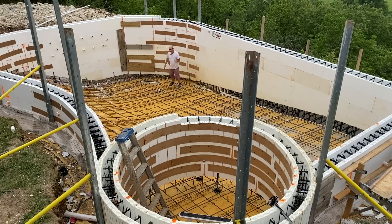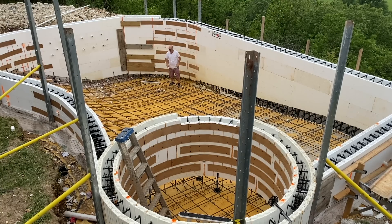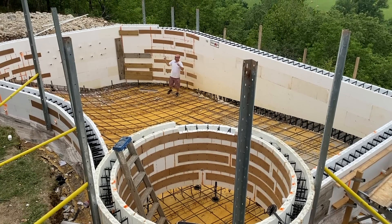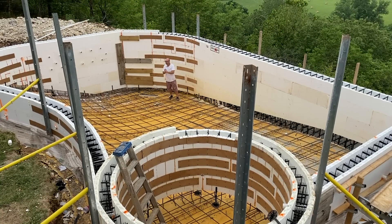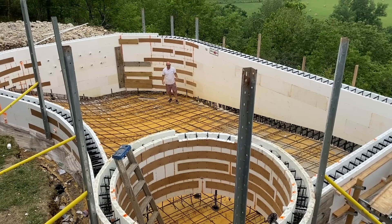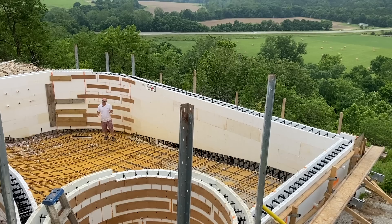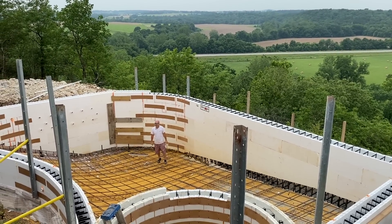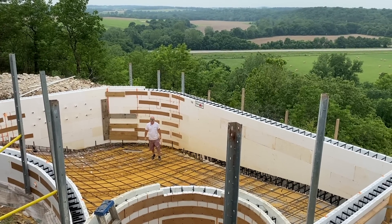If it's got a cover on it, you're completely covered. This one won't because of some architectural features. We've got our linear main drain set, and four more in the catch basin to suck most of the water out, sending it back in and over the waterfall. The hot tub is super cool because of the setting. This one is a lot of work — it's not a DIY sort of situation, but it is very viable and it's right on point cost-wise with gunite. So it's a better pool.